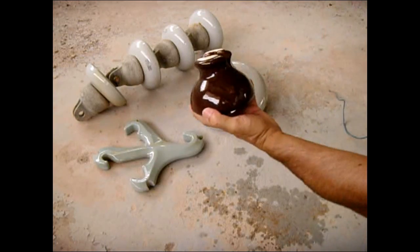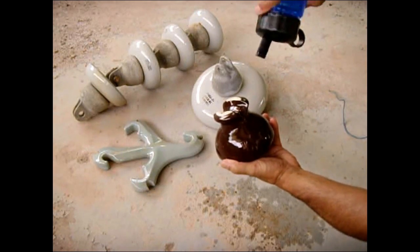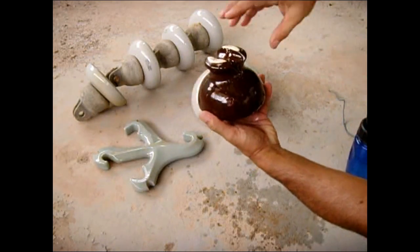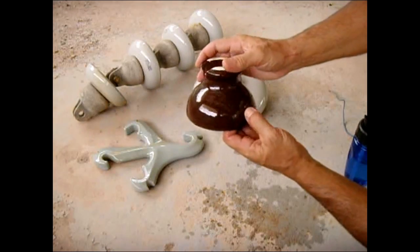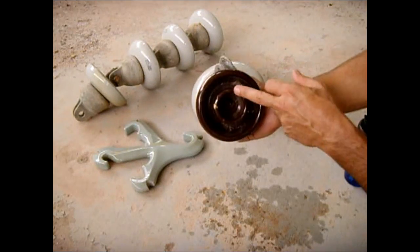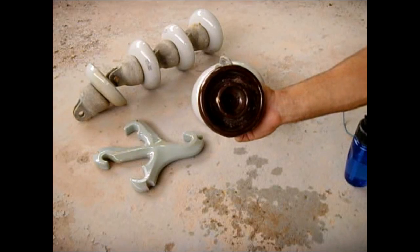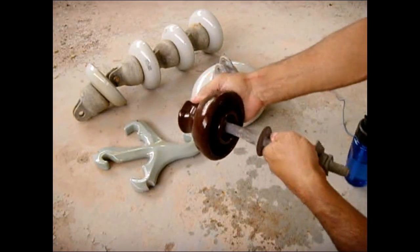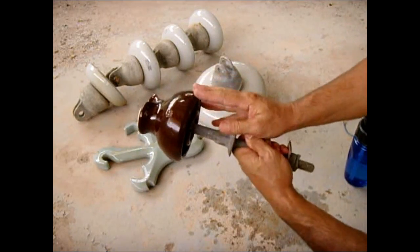This one here is a smaller version, made in 1954. It's got a nice glazed finish also, so as water lands on it the water will sheet right off. Because this one is rated at a lower voltage, you can see there are fewer ribs compared to the larger one. You don't need as many ribs — the spacing is only one gap. The same rod unscrews from this one too, as it's a standard fitting. Because the voltage is lower, it's going to have a harder time jumping across the gaps unless there's salt on it.